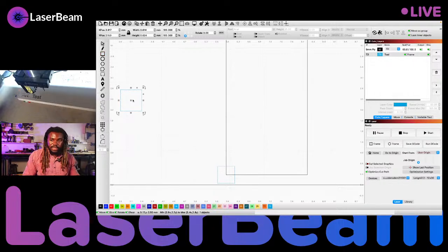So in order to use this tool, you need two boxes. You don't actually want the box to be engravable. So for me, I just use T1 or T2. These are tools. They don't actually fire. So anything that is in the color or the layer selection at T1 and T2 will never fire. Okay, you can use it to frame things. You can use it for tools like this. So that's all I did. That's why this square is at this corner.